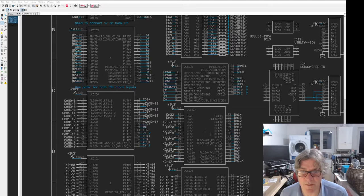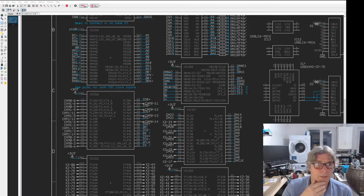And there's a few leftover pins which you use for the global clock in, which goes into that bank, because it's where it's most critical. And then we've got a TX and RX. So we've got a set of UART pins from the STM32 that chips in. That's always good to have. And that UART can then be represented on the debug USB port, rather than the high-speed USB port. We wouldn't want to waste a high-speed USB port just doing serial.